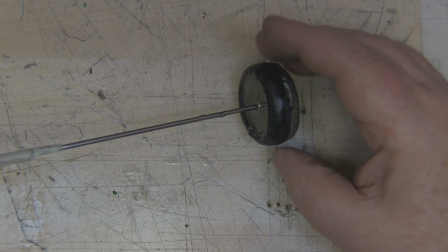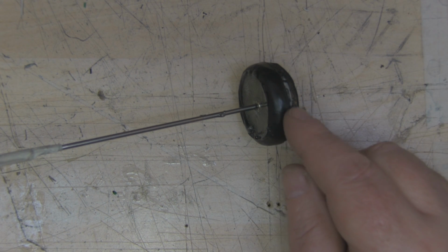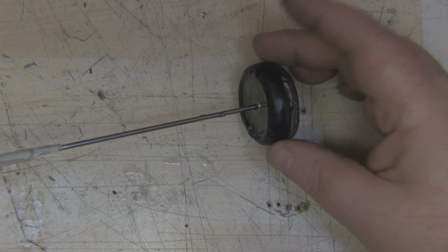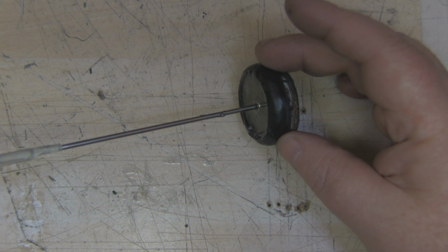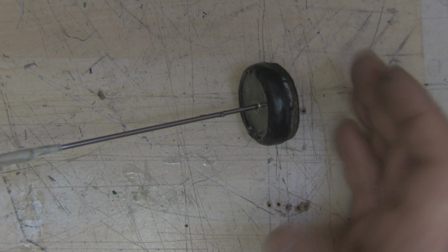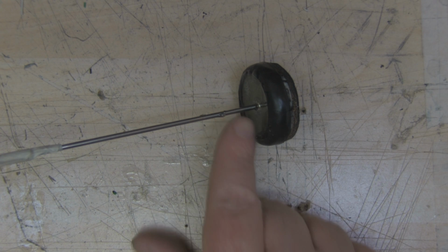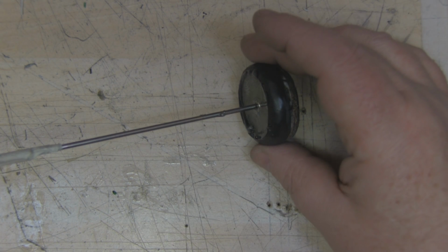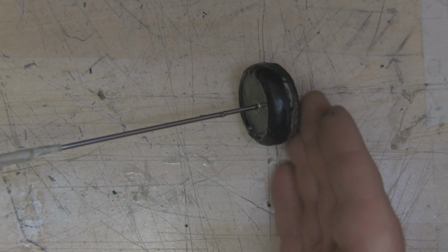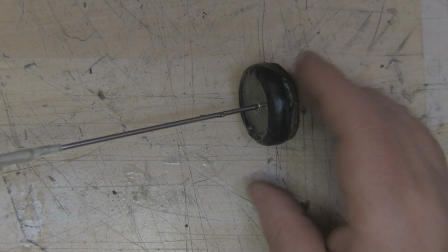To finish off the end of the helical antenna, so we can extend it and then retract it back in, I've made this little stopper out of some plastic tube in the same diameter I used to make the helical antenna. It's 42mm in diameter. I've capped off the end with some thin cork matting, and you can use plastic, something like that, just make sure it's not metal. I've attached that to the end of the aerial and potted the entire thing in there with epoxy, so it's not going to come off anytime soon, because it will take a lot of stress, a bit of strength, to retract the helical antenna and then extend it as well. So I've potted it in there so it's nice and strong.